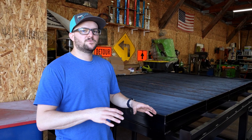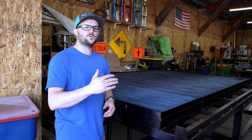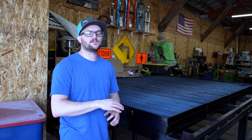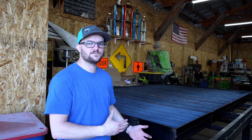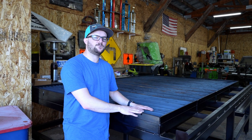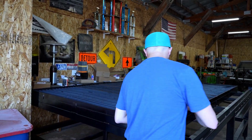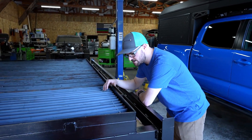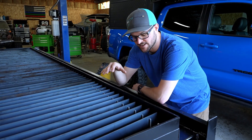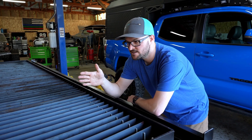Some of the stuff we've been working on is raising the slat height or the water depth. I wanted to raise it a little bit more because if it's too low and you're doing a lot of cutting, it gets a lot of slag in there and it'll fill up quickly. When I raised this, I ended up making the upper part into slat holders — kind of like a tray that sits in there. I had 260 holes in this thing that I drilled and tapped, and then I cut 260 pieces of all-thread, which are the uprights that hold the slats so they don't fall over.